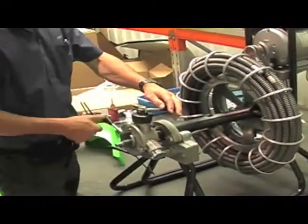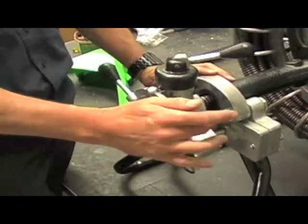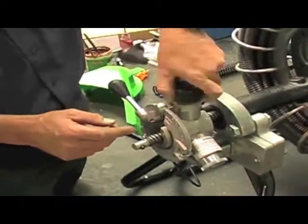The power feed is at the front with the cam plate. The main three things in the drain cleaner that you'll need to service are the three rollers in here, the power feed rollers, and the bronze torque tube bearing in there.